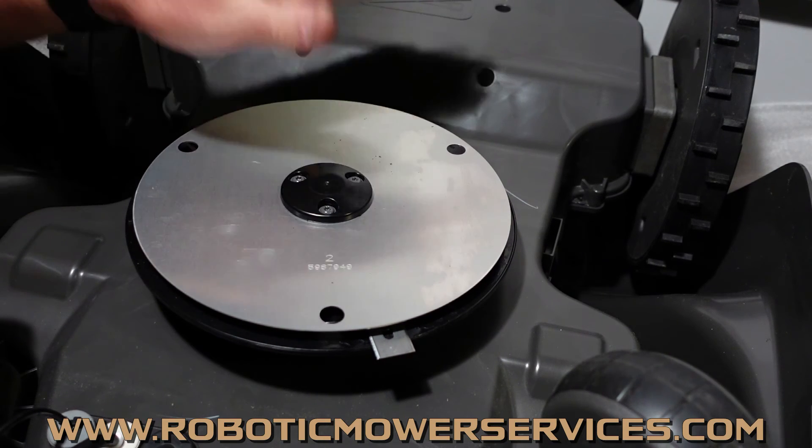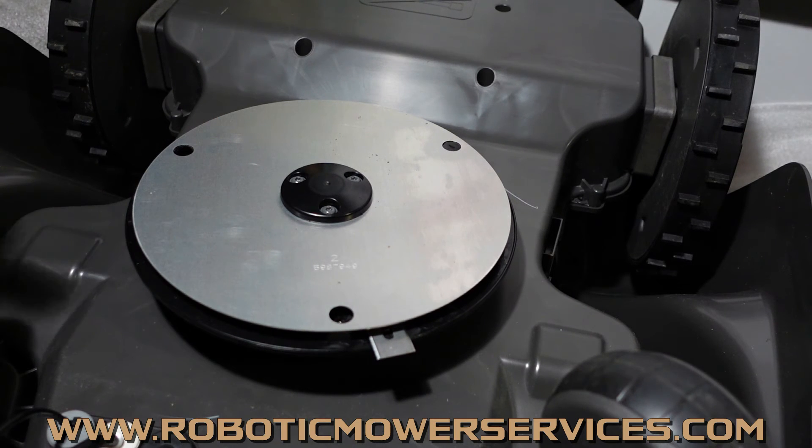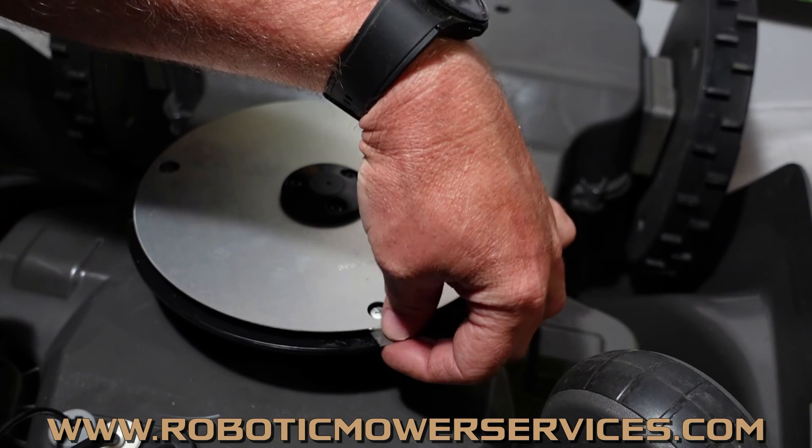Try that out before you go spending money on a five-blade disc, putting extra resistance on your cutting motor and burning up five blades instead of three. You might ask, 'Why do I have to get both? Why can't I just get the smaller shield?' Because the smaller shield is the same size as the old cutting disc — your blade would stick out a little more than with the original shield, but not as much as with the bigger disc. And if you try the bigger disc with the original shield, they're the same size, so you won't gain anything. The new style shield paired with the new style cutting disc — larger disc, smaller shield — is the way to go. It's going to get you so much better cutting quality and so much more cutting surface exposed to the grass.